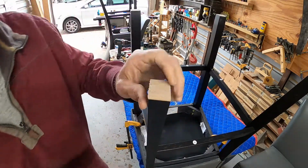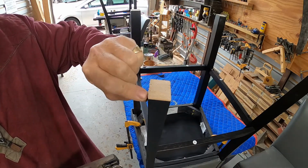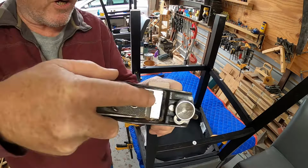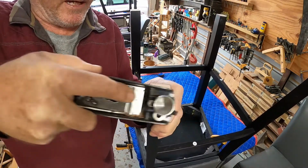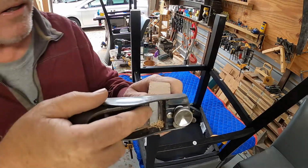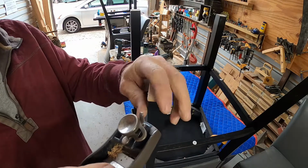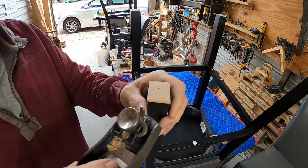They need to be chamfered because when you scoot around the floor, if it's not chamfered, this square right here, see, it's already broken from the saw. I'm going to get that off with this tool. When you scoot around, this will break, it'll peel up. So I just put a quick chamfer on with this hand plane to angle that a little bit, and I'll come back and make it the same color as the chair with some Mohawk products, the little pins that I've got for this.